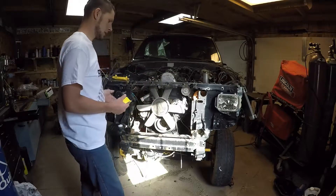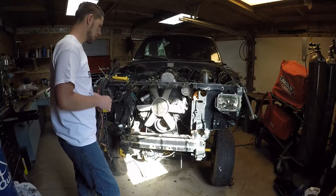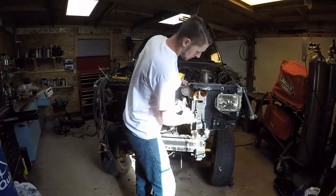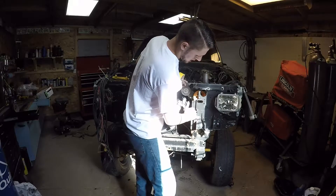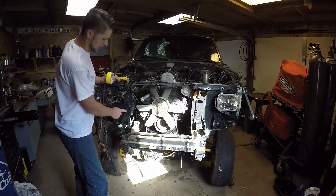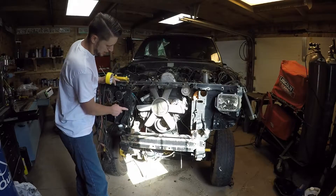The project I'm working on here actually already had a Mercedes in it at one point, so we're just going to be cleaning it up a little bit. What I usually do is I'll come about three quarters to one inch from the bracket that goes down to the body mount on the driver's side, and about a half inch over on the passenger side from the bracket edge.